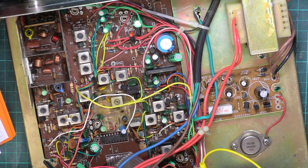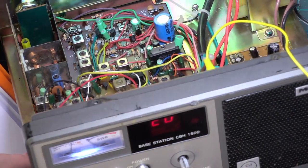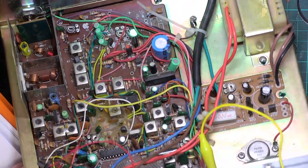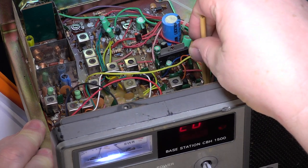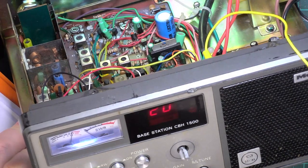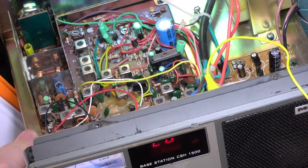Oh, let's see where the S meter is while we're on S9. And the S meter is reading 7. So I reckon it's VR1. It is. So there we are, that's now S9, and we can increase that with plus 30, we can reduce that. I've made sure RF gain is at maximum.